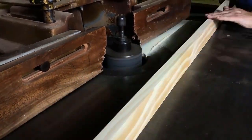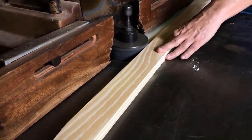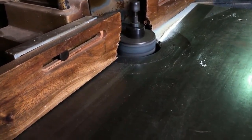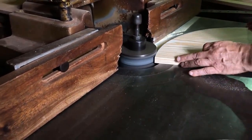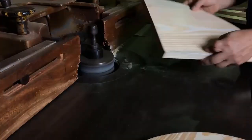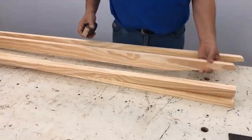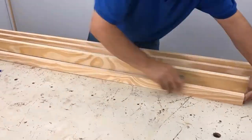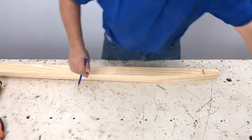For the back angle we are going to sand only two edges because one is superimposed on the other and it is screwed. Also on these corners of the curve, sand softly without squeezing because it can make small holes in the wood, especially when the grain is pointed since the wood is softer in the wider or lighter part. We sand by hand and take out the edges.